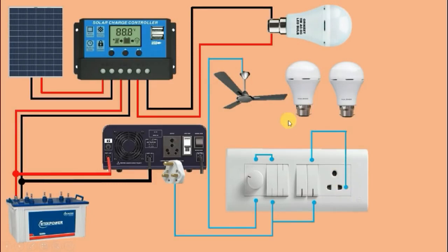Now for the first bulb, I am using another switch to control it. Connect one wire to provide input power supply to this switch, and from the outgoing terminal connect one wire and provide phase supply to the bulb. For the second bulb, I am using another switch — same connection: connect one wire from here to provide input power supply to the switch, and from the outgoing terminal connect one wire and provide phase supply to this bulb also. Phase supply connection is now completed.